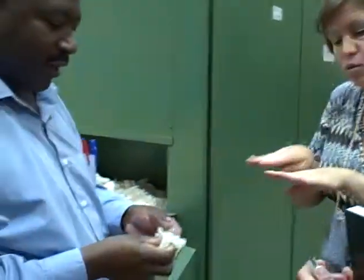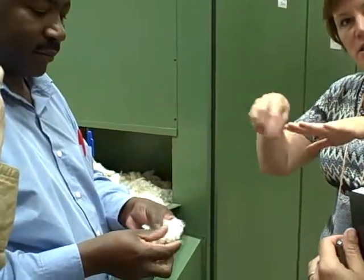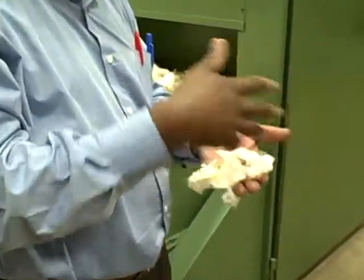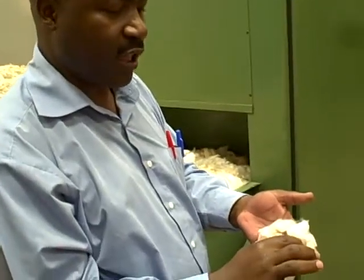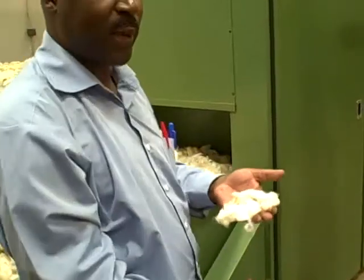So you're trying to get all the dirt, all the contamination. And ultimately, you've got to get all those fibers running parallel and straight so that they can then get spun. When you open the cotton fully, the heavy particles like sand and remains of the seed coats will drop down. We collect them from the machine, so the whole thing is well cleaned.